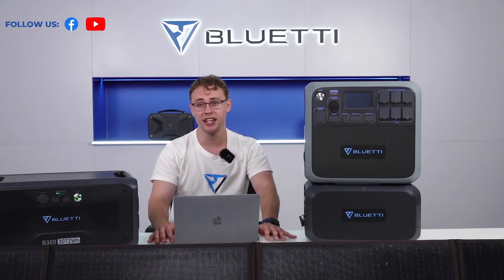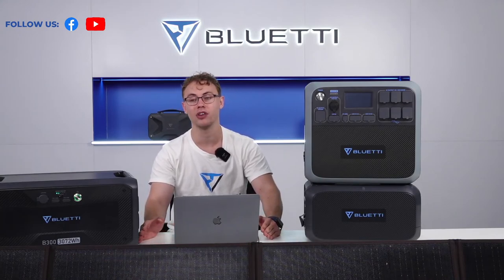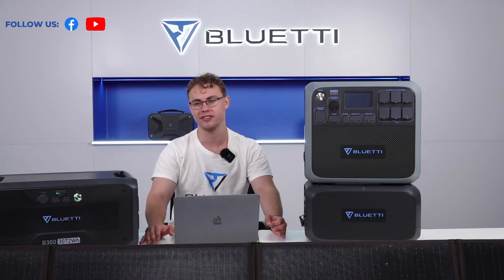Okay, so speaking about P350, the maximum input is 350 watts, as you can see from the name. Lamination is ETFE, cell efficiency is up to 23.4%, maximum power voltage is 37.5 volts, current at max power is 9.2 amps, open circuit voltage is 46.5 volts, short circuit current ISC is 10.8 amps, operating temperature is from 14 to 149 degrees Fahrenheit, and best working temperature is 77 degrees Fahrenheit.